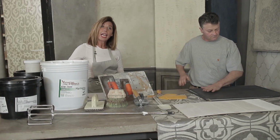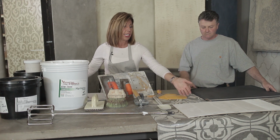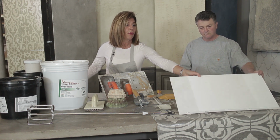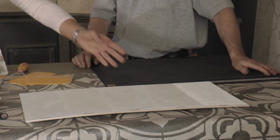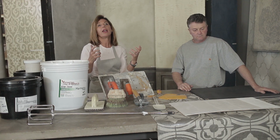It's manufactured with premium grade magnesium slaked lime and marble. So it's basically like putting stone on your walls. It comes in a number of different sheens, which we can look at here, but we're going to be using the Piatto product, which has a really nice matte finish. It also has a thick aggregate so that you can get a little bit more substance, so you can cover up some of the imperfections on your walls.